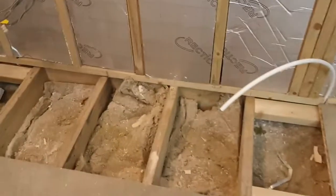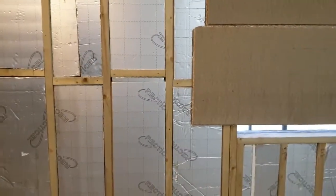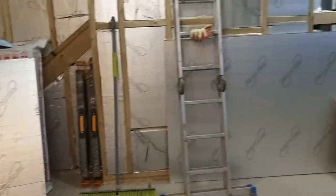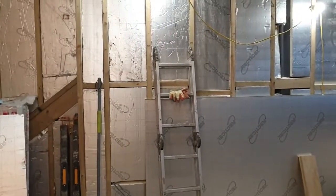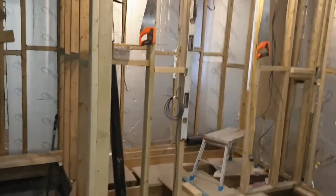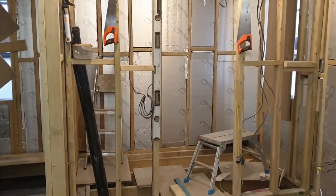So this room is now completely and finally insulated. The floor is insulated, which we saw previously - that was the soft rockwool that comes in big bags, which you just roll out a bit like carpet underlay. We've got all of that in the floor, and on the walls we've got the solid insulation cut to size. This is now ready for inspection by building control. Once they've agreed that it's all to their satisfaction, we can then put the plasterboard on, then plaster, and we're into the second fix - fitting all the light fittings and switches. The next phase, once we've put the plasterboard in, is to install the shower, shower valve, toilet, sink and radiator in the bathroom, and we'll also be putting a radiator under this window.